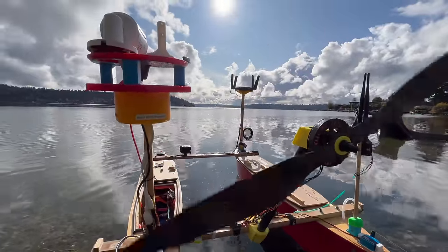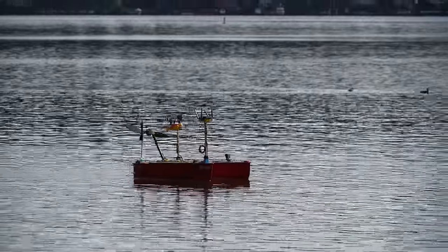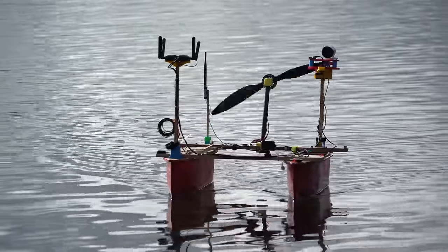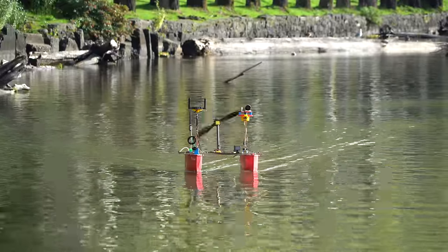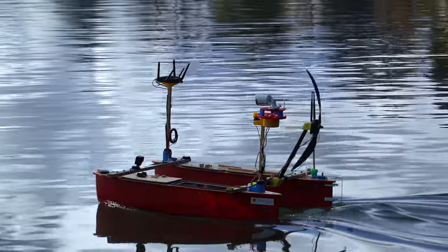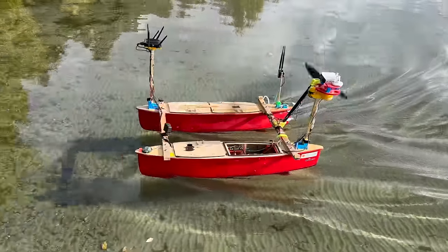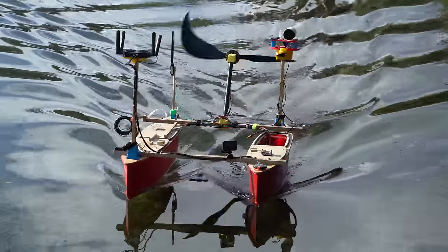So let's try out a huge air propeller. This is the same 8108 100kV multi-rotor motor that I was using on the paddle, but now it's got a 30-inch prop — that's pretty big. The prop is spinning quite slowly. At a cruise speed of around 1 knot you can visibly see the propeller go round and round. It took very little throttle to cruise nice and slow, and when I raised the throttle a bit, it would get moving pretty quickly. I got up to 2 meters per second, but the max speed is kind of irrelevant because I had the throttle PWM artificially capped so that I wouldn't pull too much current and burn something out with the pretty small ESCs on this thing.